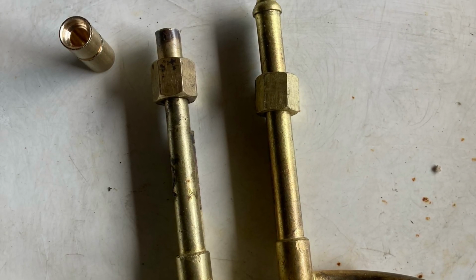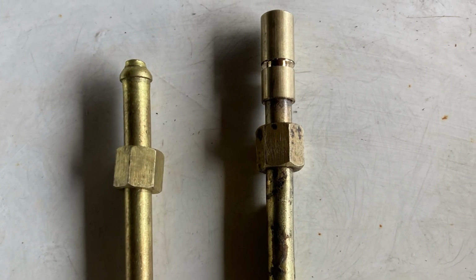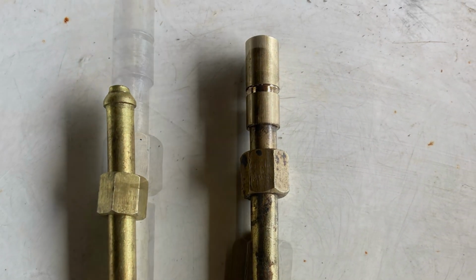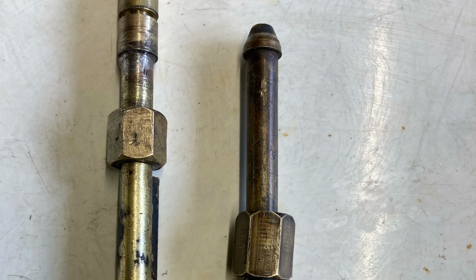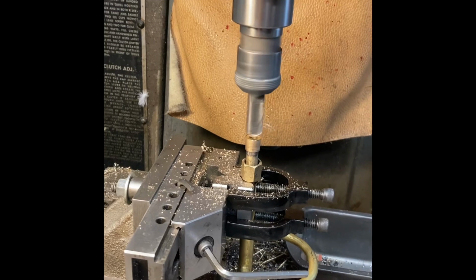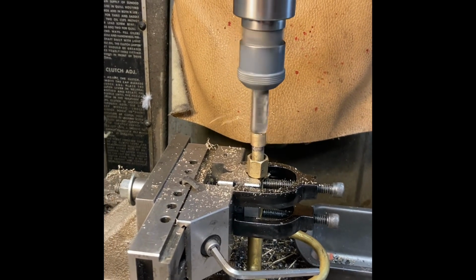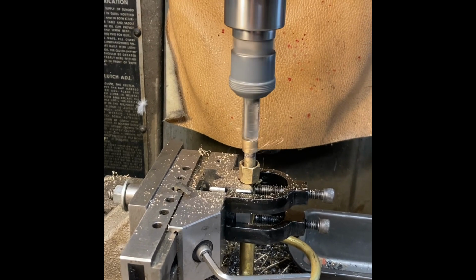What we have here is a Petromax generator. It had a failure. I ordered a replacement, and of course it was too long. So here you can see plainly the original one had a failure. The mantle had burned through. Put a hole in the generator, catastrophic failure.